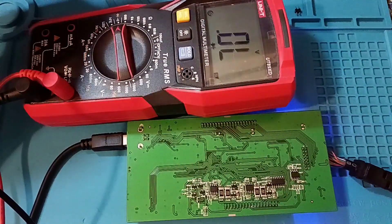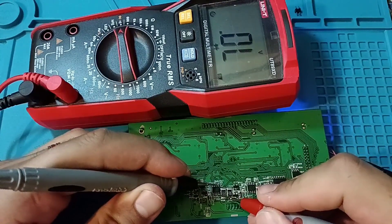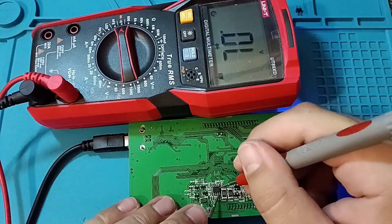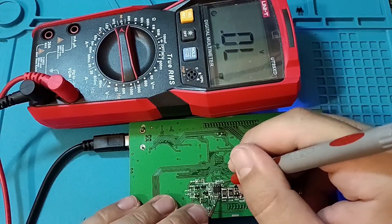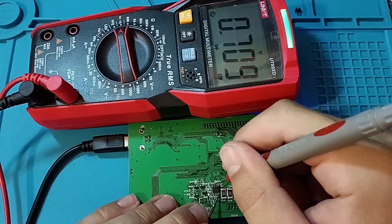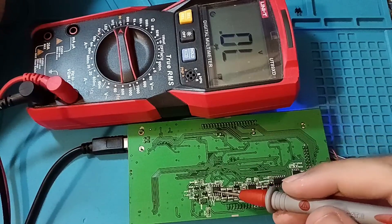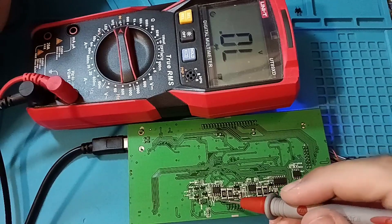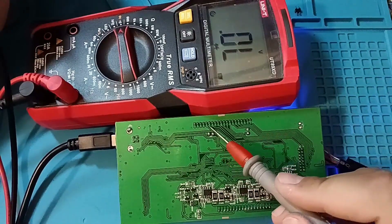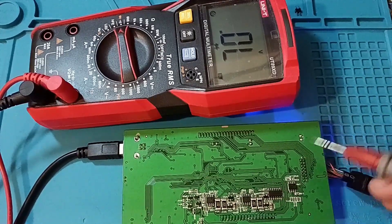Let's go to diode mode and measure this chip. You see the diode sign here — let's measure this chip. The chip is not dead, and we have a problem with this PCB trace. This is the reason why this thing doesn't work — you notice this is very bad quality, it has only one line here. This is how we can measure the voltage, and now we can check the relays.